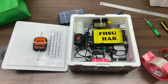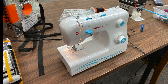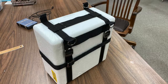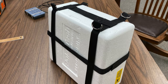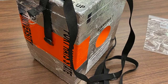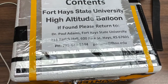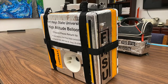When you have your payload all securely fastened into the payload box and all the labeling done, the last thing we're going to do is make a harness so that we can attach the payload box to the balloon and the parachute. I have sewn these harnesses out of 1-inch webbing with D-rings sewn in. This provides a secure mounting point and makes it easy to open and close the box. When you are designing your box and your harness, make sure that your harness does not interfere with any of the instruments in the box — for instance, you don't want a harness strap to go directly over the lens of your camera.